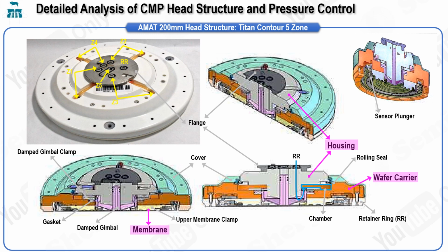Early designs of CMP heads employed various methods, including the gimbal system, which relied on a backing material elastomer, and the back pressure system, which utilized a bladder. However, in modern semiconductor device fabrication, the floating membrane type has become the standard due to its superior ability to achieve consistent results. On the other hand, when polishing silicon wafers after the slicing process for wafer production, the process is relatively simpler and less technically demanding.